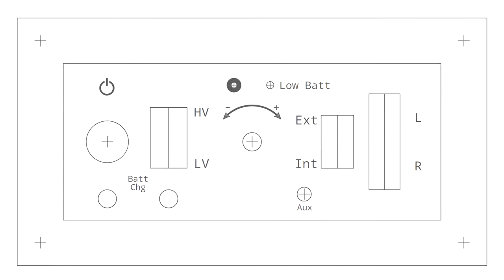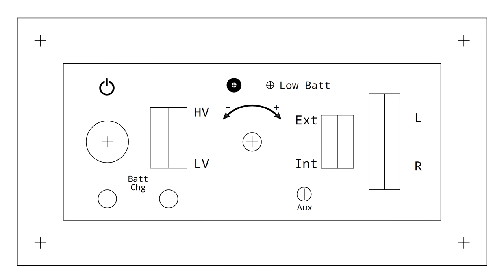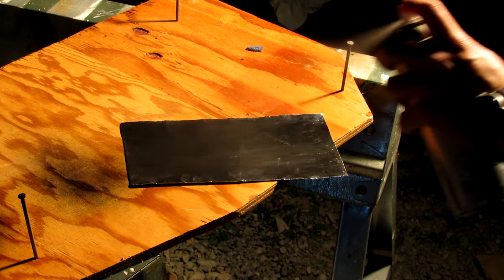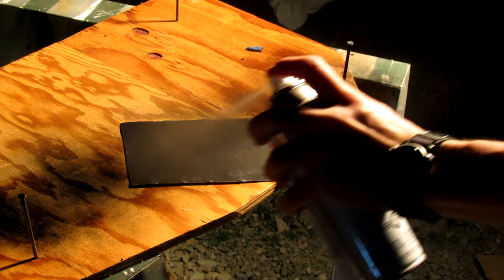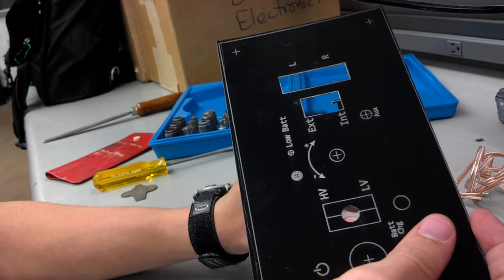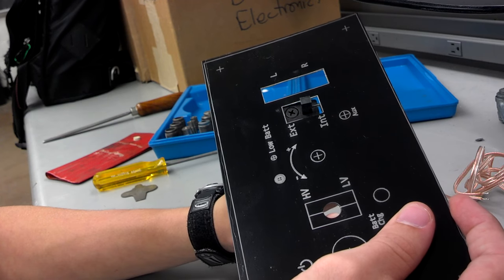Here's the diagram for how the front panel looks, and I decided to go the extra mile and laser etch some designs and labels into the piece so I could know what all the switches do. All I did was put a thin but complete coat of black metal paint onto a scrap piece of stainless steel I cut, then it was off to the laser etcher, and after a few passes it looked pretty good. A few coats of glossy clear coat were added to protect the paint — the glossy finish makes the blacks darker and makes the silver pop out more. The holes for the circular components were cut using a hole punch, and the larger and rectangular holes were cut with a nibbler, which gave the rectangular edges a very clean look.